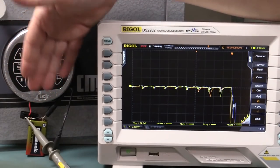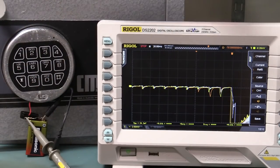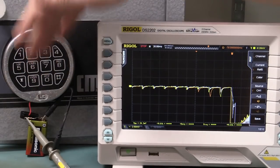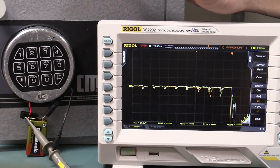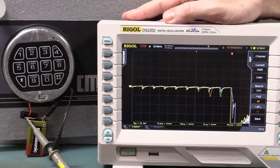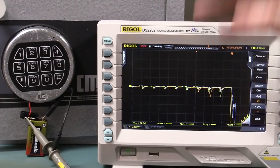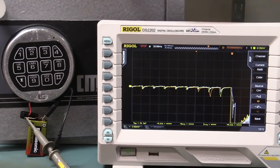Just once again, a very basic power line analysis, as simple as you can get, with a 10 ohm dropper resistor in series like that, and just a scope probe and a scope doing that. You can get better tools for the job, like the ChipWhisperer, which I had, and things like that. You can really gain it up and see the noise and get averages and get the data out of the noise and all sorts of things. So I'll probably still get complaints from people, oh, I didn't go far enough. But anyway, that's all I've got time for now.